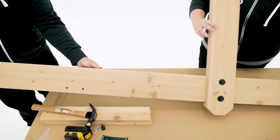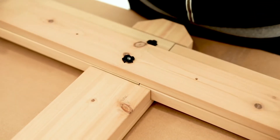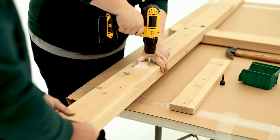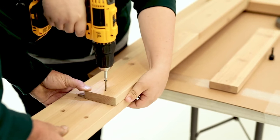Once it is secured, flip the entire assembly back over. Make sure the top of the gable inside is flush to the top of the gable beams and attach with wood screws. To complete the assembly, place and secure a gable end tight to each end of the gable inside and flush to the top of the gable beams.